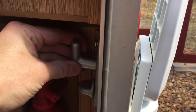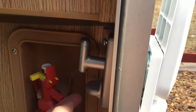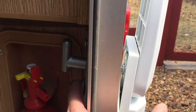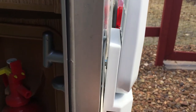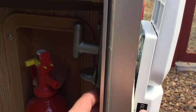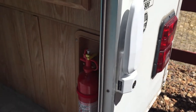When it's locked vertically the handle won't work. You can basically make this in any orientation you want — it's all about how the pins line up. We're going to bolt it up, and as always I'm going to put a little sealant around the outside. Even though it has a rubber gasket, I'll put some sealant around the outside just to make sure it's nice and watertight.